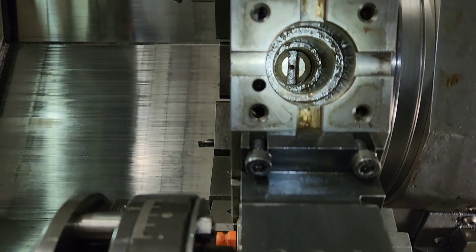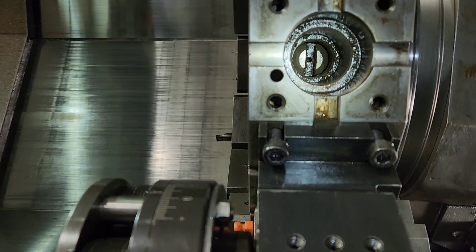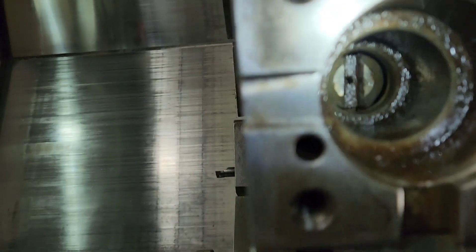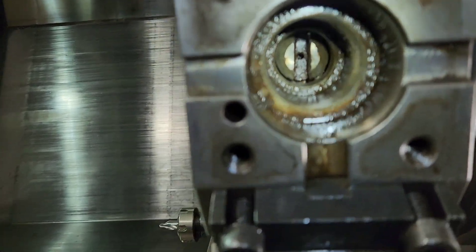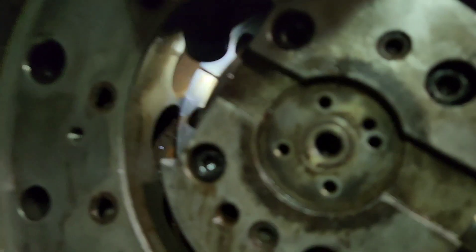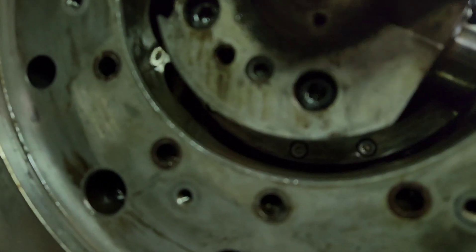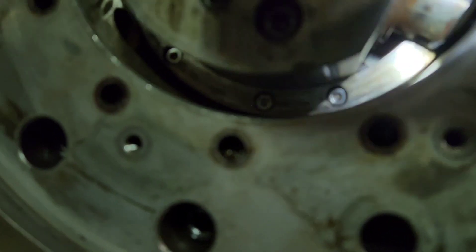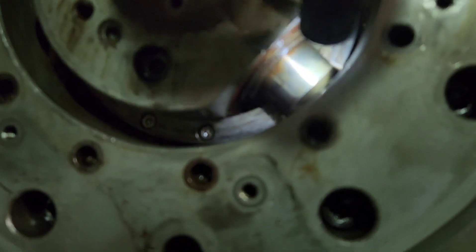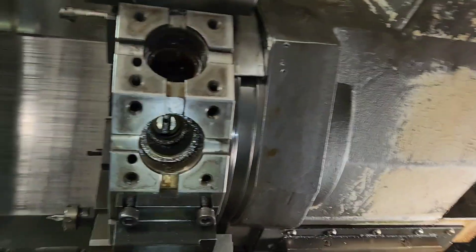So when you get x-axis, that drive unit parallel to x-axis travel, that's going to be lined up. And that slot has to be lined up perfect too. The tools orient against this plate right here — that's what keeps the tool straight. If this drive right here is turned, it's going to crash. And that's what this whole problem is about.